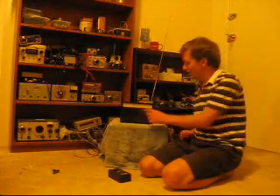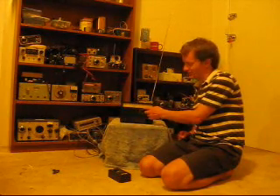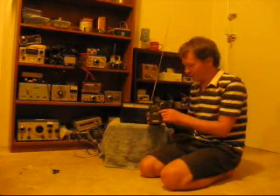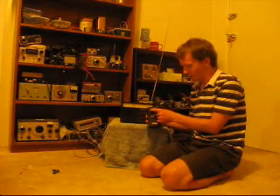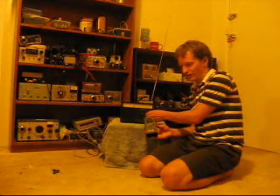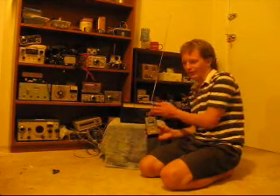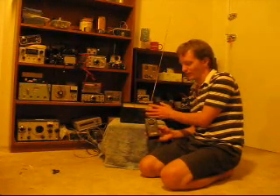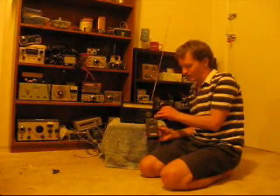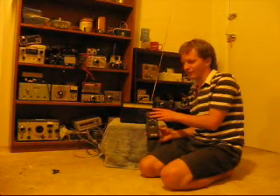The first challenge with a cheap receiver is how do you find 40m. Often they've got a band that's many MHz wide — 40m might only be a few millimetres on the dial. Well, luckily with the BFO, you set it to a frequency like 3.6 MHz, you turn it on, you tune across, and you hear a strong signal. In this case, as we're tuning 40m, it's 3.6 times 2, or 7.2 MHz. Now, you can only do this with a signal frequency BFO. If it's a 455kHz BFO, you won't be able to do this unless you happen to be on a harmonic.